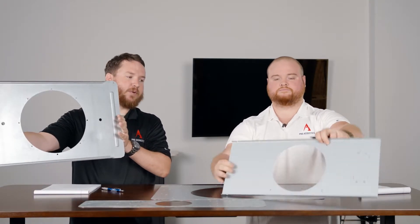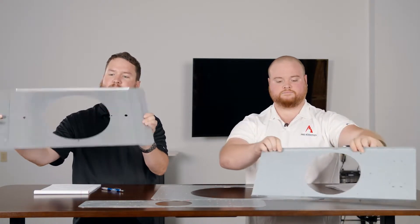If you do have a connection for a safety cable on a speaker, we recommend that you always use that whenever possible. So basically, if you've got a speaker going into a 2x2 grid, you don't want to just mount it to the tile. Enter tile bridges — these two-foot-wide bridges actually lay into the T-bar ceiling, and then the speaker itself mounts to the tile bridge. It's secured and helps distribute the weight across the overall ceiling. These are important especially in seismic locations like California, or if the roof or AC vent leaks and causes tile damage, making ceiling speakers unsecured. That is where tile bridges come into play.